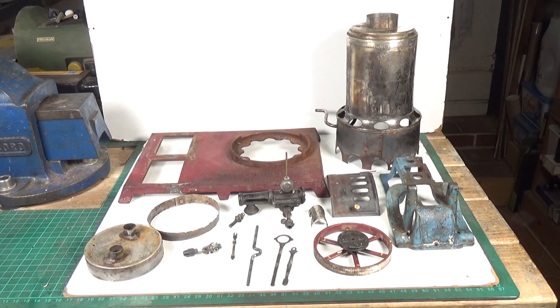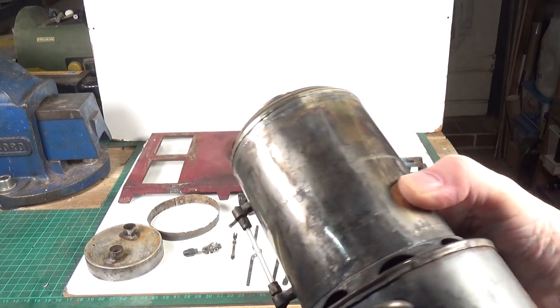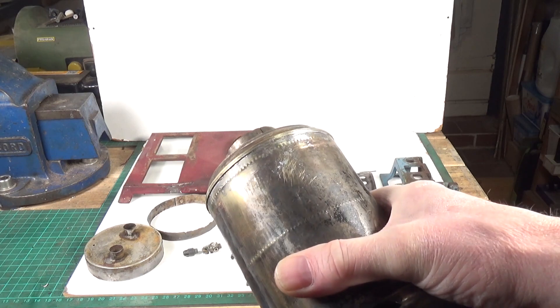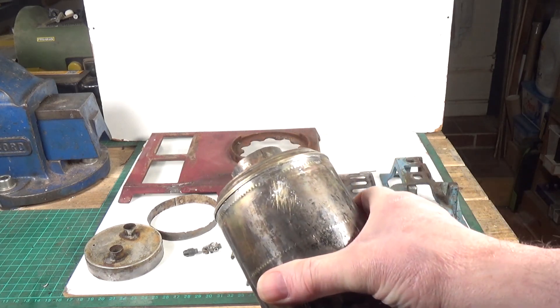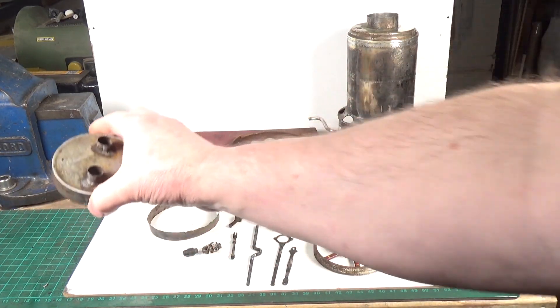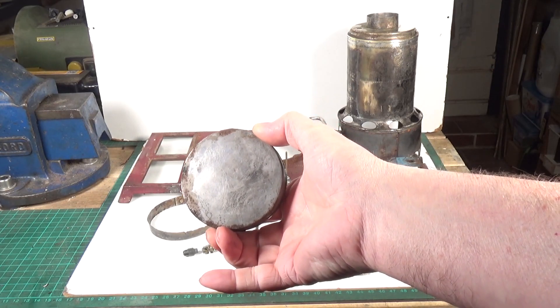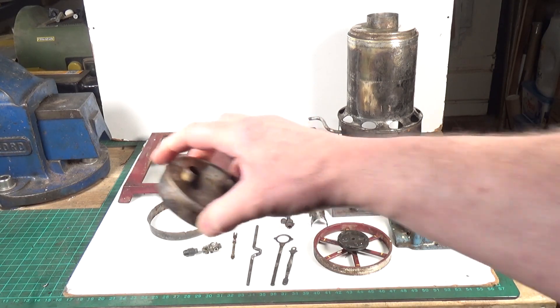I've done a little bit of work on the Weedon 49. It's been stripped down into its component parts. I had a go with a small kitchen blowtorch on the seam and all that horrible solder around the top cap. Just by using a screwdriver, melting the solder and scraping off, I was able to get a vast majority of it off, and you can now see the rivet detail has come back up quite nicely. I still need to check that the boiler seals. The burner has cleaned up very well — it's spent a couple of days in a bath of vinegar, the magic de-rusting solution. There are still some pinprick holes and a dent which I think also leaks.